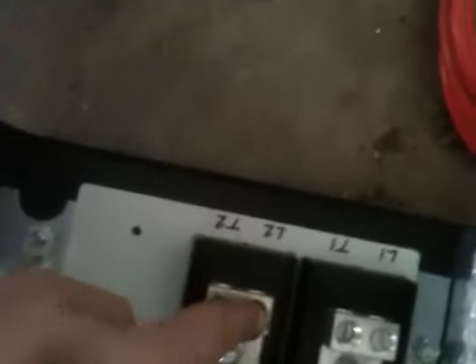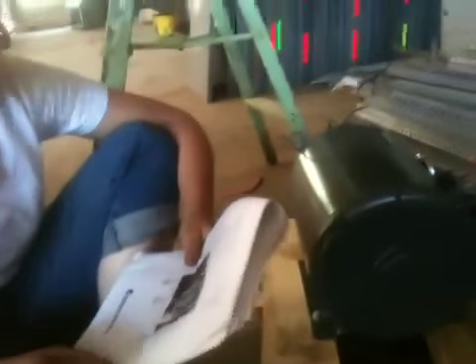And the input from the line from whatever the generator is — that's L1 and L2, that's single-phase. And then T1, T2, T3 is the three-phase output. A, B, C is what comes in from the converter — they call it an idler or a generator. So there's nine wires there. Why are there so many? I don't know — I'm just going to follow the instructions.